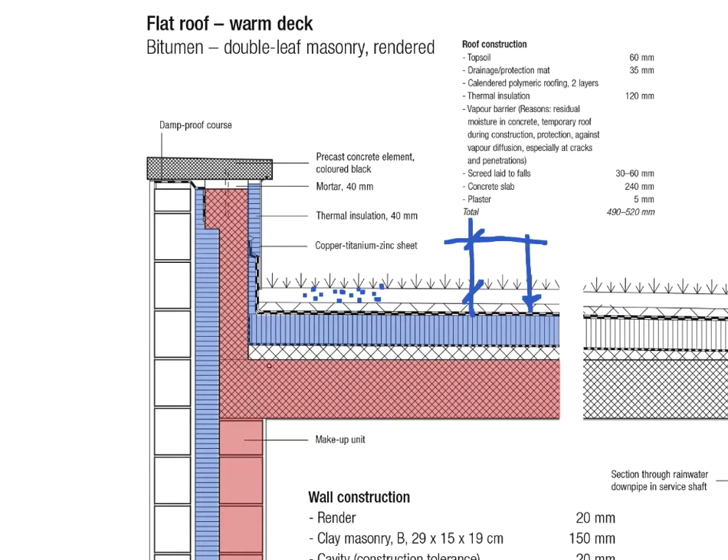As you can see here with the concrete, there's a working gap. The roof slab was cast in one go — or maybe multiple pours, depending on the size of the building — and then in a second process they cast that additional element on top of it. That element could also be precast, just like the one on top, if that would make sense in that particular instance.